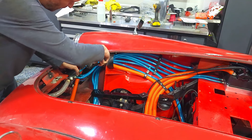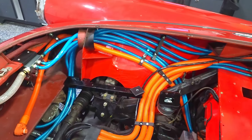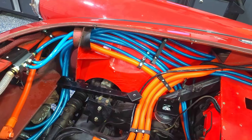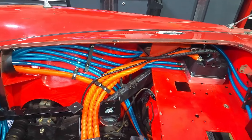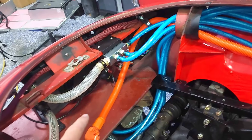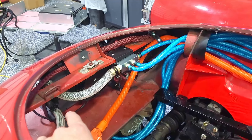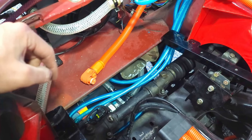I think we've got the cooling lines pretty much all done. Basically there are eight lines: two for the front battery box — supply and return; two for the rear battery boxes — supply and return; two for the motor controller — supply and return; and two for the overflow tank. Then we've got it going from the return into the radiator, the radiator goes down to the pump, and the pump goes over to essentially another distribution block and they all flow out. We got a lot done — all the cooling is sorted. Next is wiring. There were some stray wires along the way and wiring is already underway. Stay tuned, see you next time.